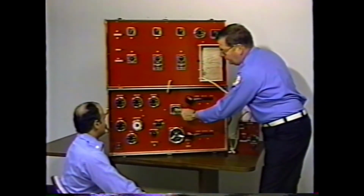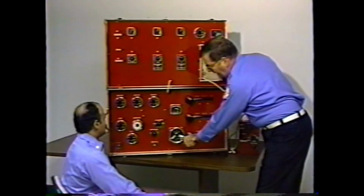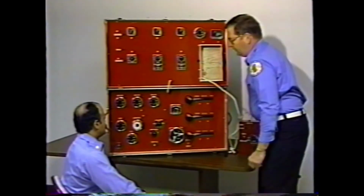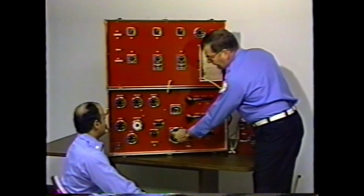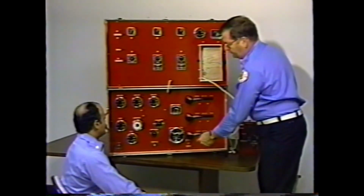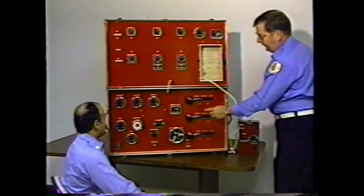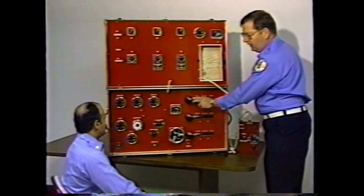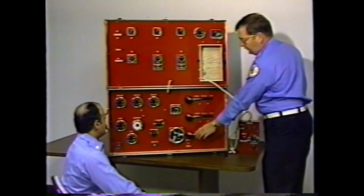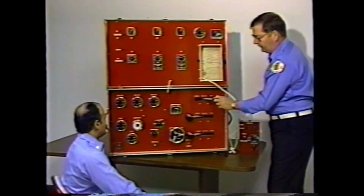This changes from pressure to volume, or series into pressure. A relief valve that operates from 500 psi down to 90 psi. This valve operates such that a counterclockwise operation decreases the pressure, and an increase in pressure is caused by a clockwise operation. In addition, the student operates 3 valves. The 3 valves are connected permanently on this simulator to a 1.5 inch, 2.5 inch, and 3-inch hose respectively. The 1.5 inch hose will be fit into any type of nozzle that is desired by the instructor.